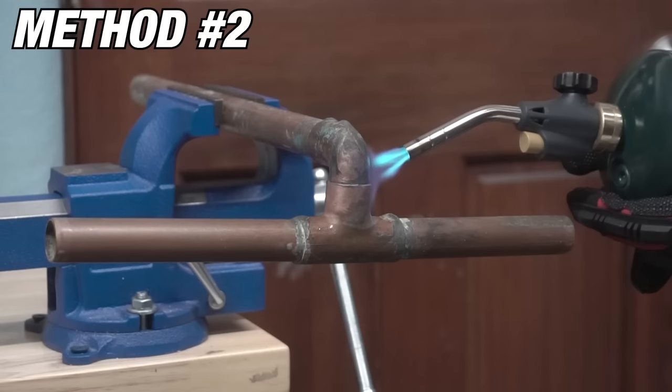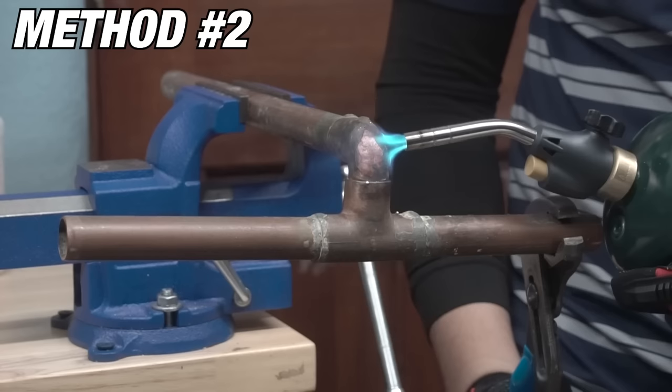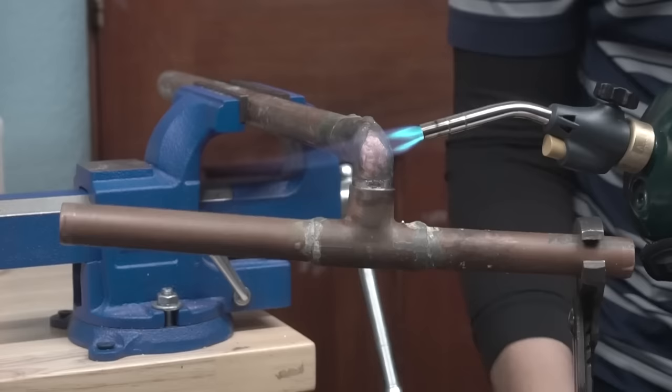I am using this to show you the second method, which is torching it and putting solder. You can tell that it starts heating up, and all the solder is starting to come out. Just a tip, when you're trying to disconnect a solder connection, take your wet rag and wrap it around the other joints so that they don't get affected and don't come off. Use some kind of clamp. This one I'm using my Channellock pliers because this pipe will get really, really hot.